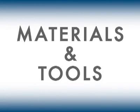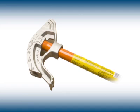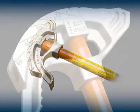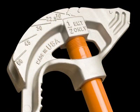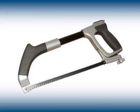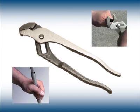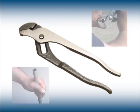The tools you'll need for bending conduit are: enough conduit for your project, and a hand conduit bender. Make sure it's matched to the diameter conduit you'll be bending. We're using half-inch electrical metal tubing or EMT from Columbia MBF, so we'll be using a half-inch hand bender. A hacksaw to cut the conduit to length, and pliers to deburr conduit IDs and ODs, or you can invest in a conduit reamer.